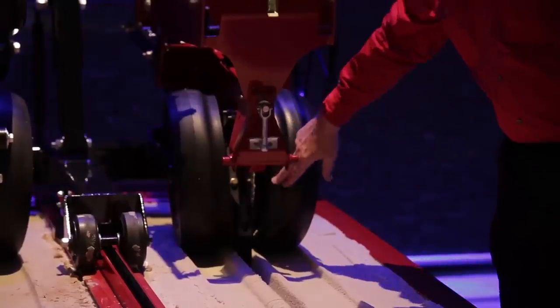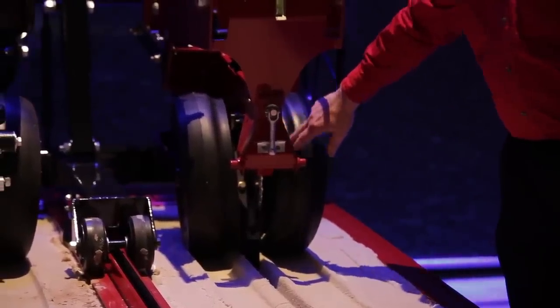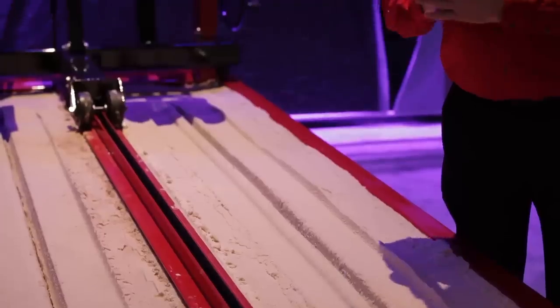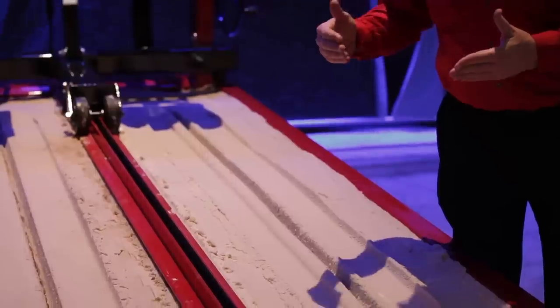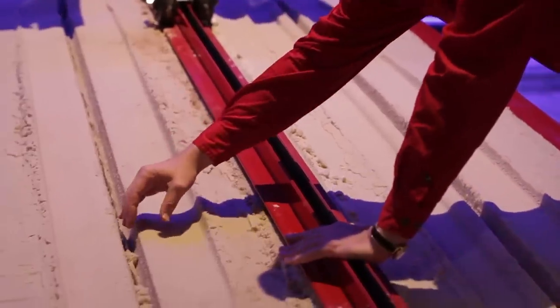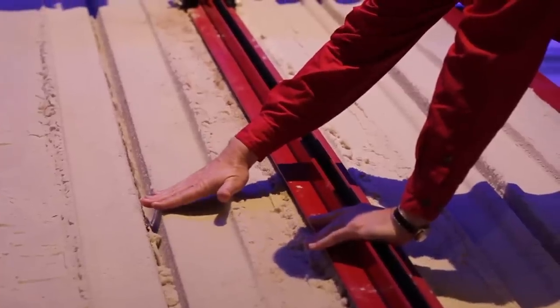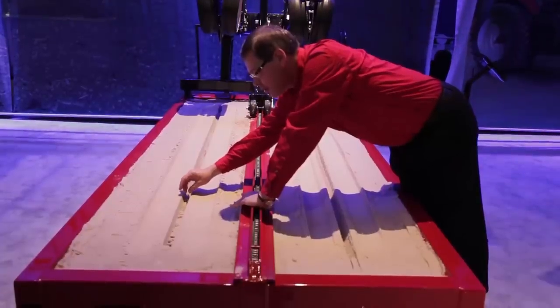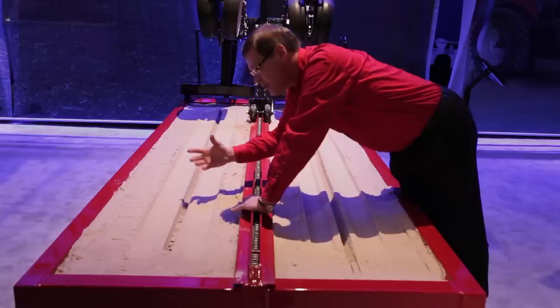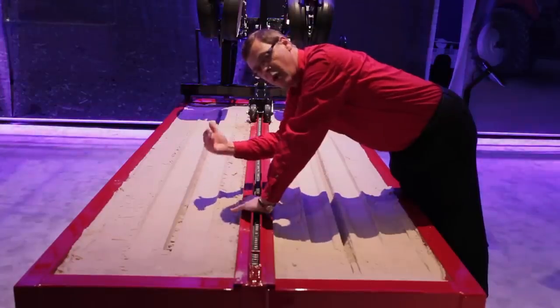That is the result of two reduced-radius gauge wheels, and it has a storage groove for soil right here. That soil is trapped as it comes out of the seed trench and parked along the trench — that soil will be used to cover the seed. On the conventional side, a push gauge wheel pulls the soil out, traps it, and smashes it down on top of the seed trench, crushing about a third of an inch of soil against the side — using compaction to hold the seed trench open.